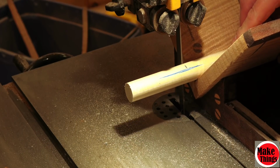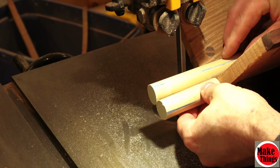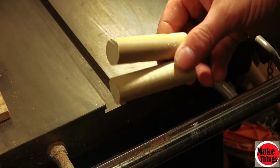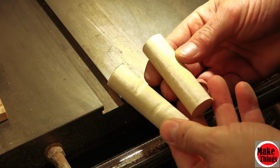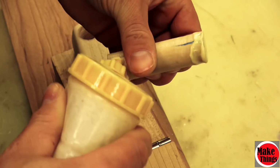I cut a couple 1-inch dowel rods to 3 inches with my bandsaw jig. I don't recommend cutting dowels on the bandsaw otherwise, as it can be very dangerous. The jig for cutting dowels will be in the description below. After gluing, I tap the dowels in.